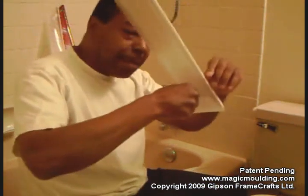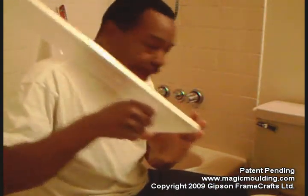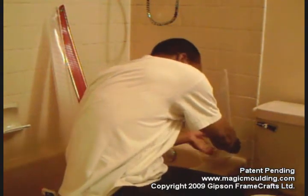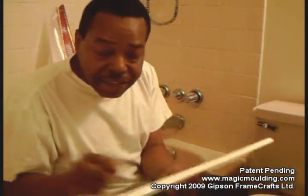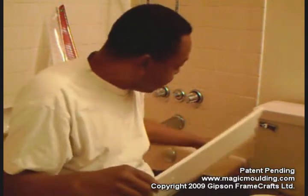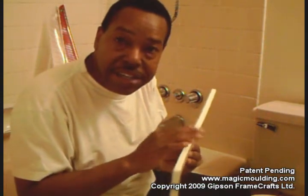And then you peel a bit of adhesive off the base. You put this in at the grout where you want it. You lay it down and bring it up the side. We can't get to that until we've cleaned this thoroughly, because this adhesive is really tacky, but it won't go on if it's going on to a dirty surface. If there's soap scum or anything on the top of the tub or the tile, the adhesive is not going to stick very well.